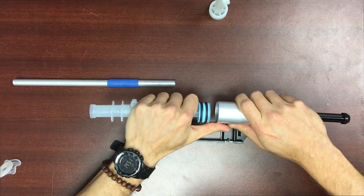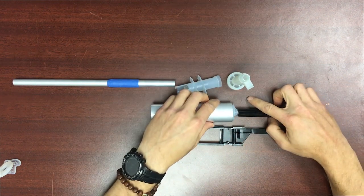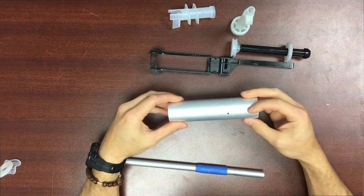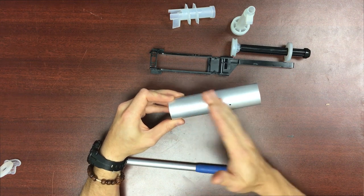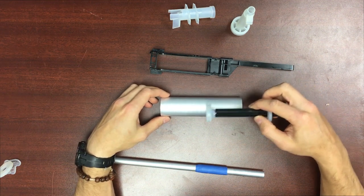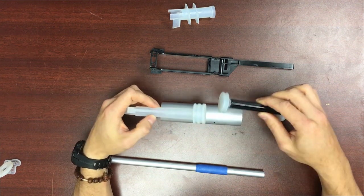For this build I'm going to walk through how I've been assembling and testing these components. The first thing you're going to want to do is find where your plunger seals and how far back your plunger rod moves when you prime — you'll have to mock up and test. I'm not going to give you my dimensions here because depending on your breech length things are going to move back further or less far.